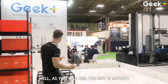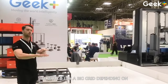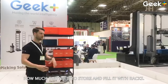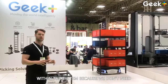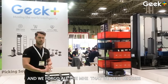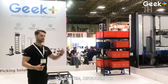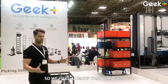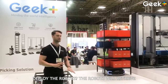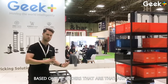So how does the system work? As you can see, the bot is moving behind me within a grid. The basics of the system are: we lay a big grid, depending on what you need to store and how much, and fill it with racks. We gain 30% extra storage within this system because we don't need all the aisles required for walking up and down, and we forgo all the MHE because the robots are moving the stuff around. All we need are a few aisles for the robots to traverse the system and bring the goods to the person. We fill the grid with goods and then deploy the robots. The robots retrieve the racks containing the goods needed based on orders put into the system.